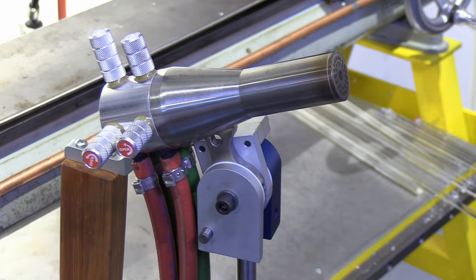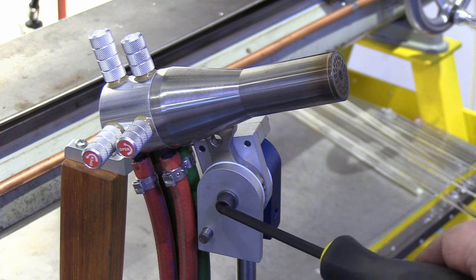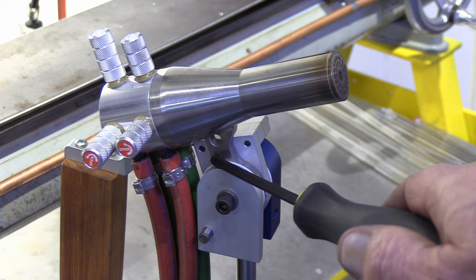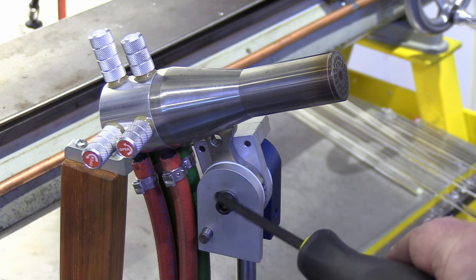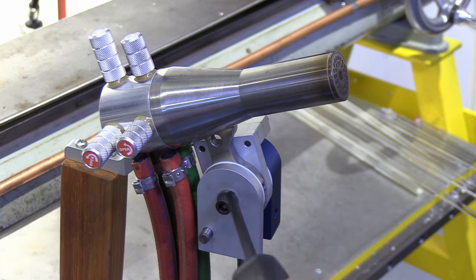Turning it around, I want to talk about creating friction on rotary axes. What you don't want is the screw head pressing down on a loose washer that's free to rotate against the Teflon, because the Teflon would grab the washer, the washer would grab the screw head, and as you move the torch up and down you'd be unscrewing the screw.